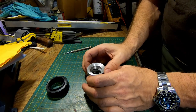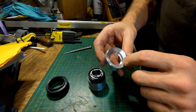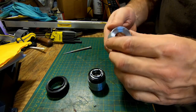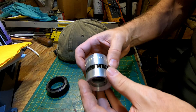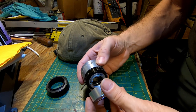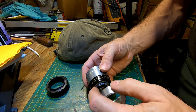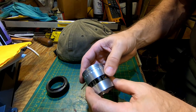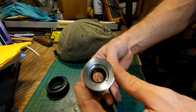What I've done is marked all three of the tabs inside this ring, which will allow me to just take a file and quickly cut these sections out - I'll be done with that segment really quickly. Now I've got it to where it fits over the bayonet lugs, but it's bottoming out on this flange. I haven't got the distance from the back of the lug to that shoulder right - it's too long. I've got the clearance to clear the flange but I'm hitting the edge of the focus helicoid, so I'm going to have to go do some more measuring and take some more off.